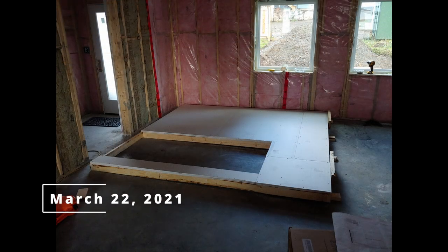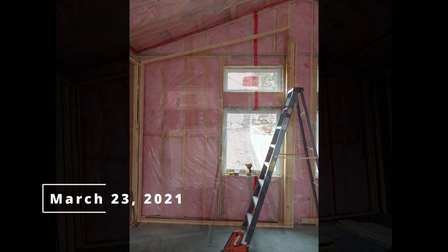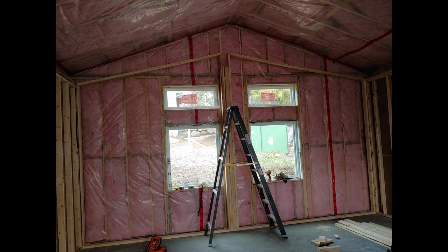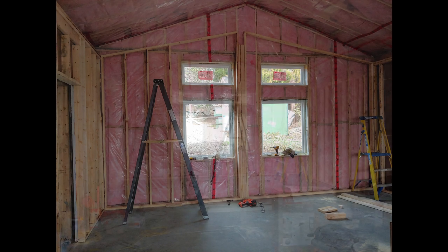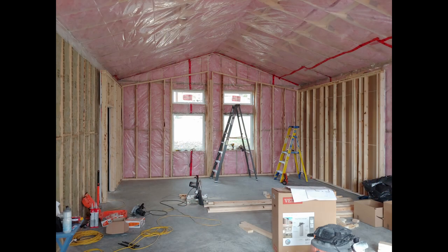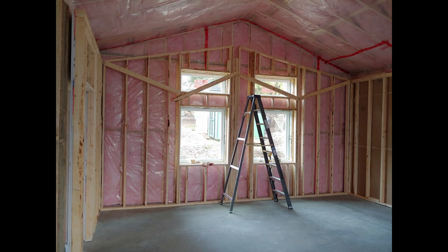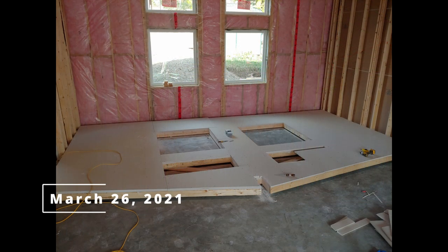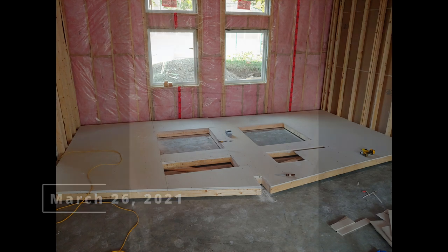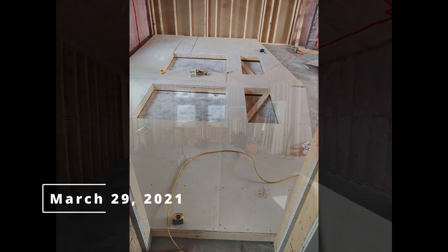I quickly got the other side wall done with the door, and then built the giant back wall with the windows. I framed it out first — it had a roof angle of about 12 degrees — and built it in two sections attached with double studs in the middle. That way, when I laid it down and put the drywall on, I could overlap the drywall between the two sections, creating a seam we could acoustically seal when we lifted it into place. Because it was two sections, we were able to lift it with four people for each section. As soon as that was done, I started on the control room walls.